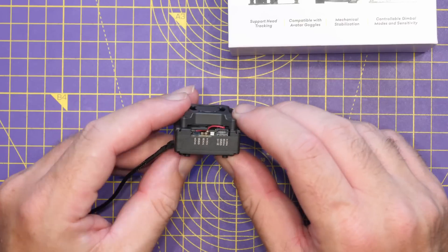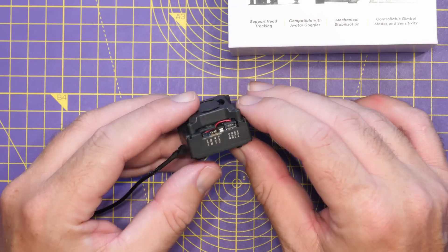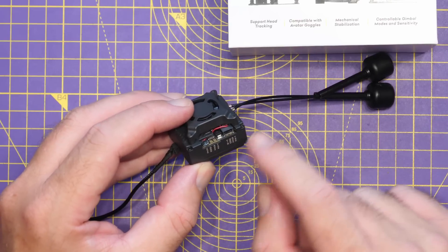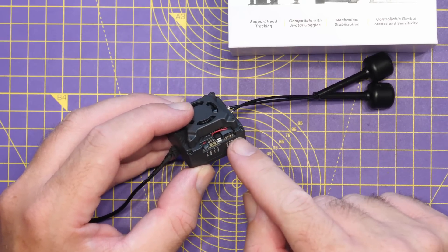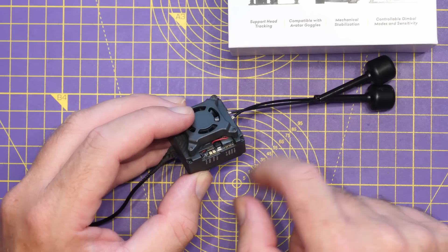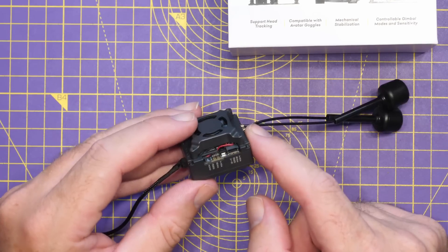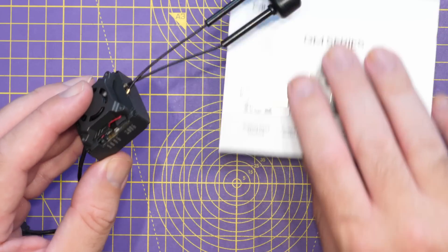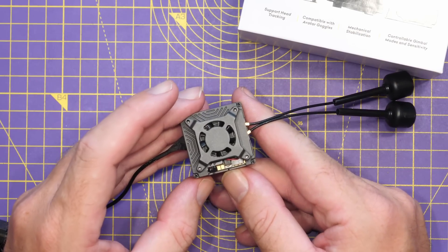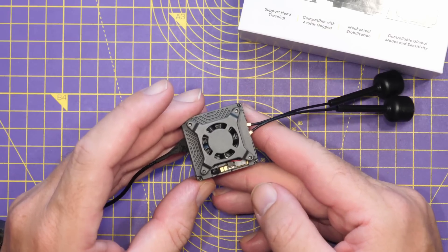Moving the gimbal box out of the way, you can see we've got TX and RX2 on the side — they've actually pinned the pads out twice. What they should have done is put a TX and RX2 on one connector and a TX and RX3 on the other connector, but unfortunately they didn't. However, there is a way to use this gimbal with this VTX because there is an internal TX and RX3 port — but to access it, you're going to need to tear it down.